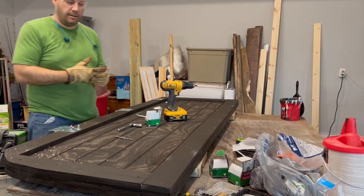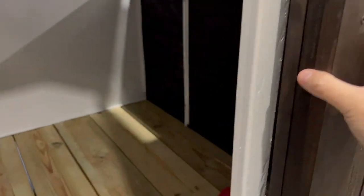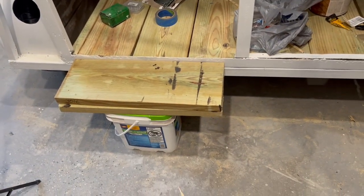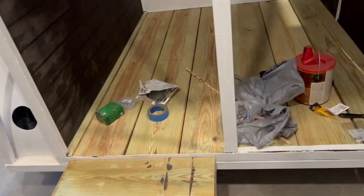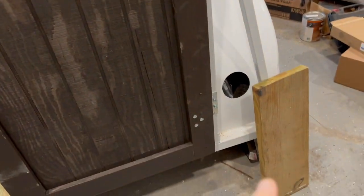I've got one of the back doors put on. I fashioned these hinges the exact same way as the hinges on the front doors. You can see it opens up — one, two, three hinges. This door is somewhat heavy. To get it in place, I used a cat litter bucket with two two-by-tens on it as a template to support the door, and then I used a level to make sure it was plumb before securing everything.